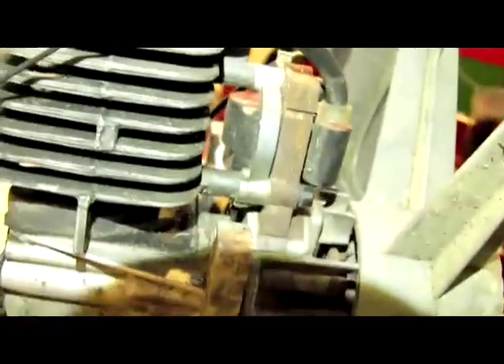That's why these have a pull string when you start them. The pull string actually connects to this part. So you pull it, you get the process going, the gas is sucked in, the electrical charge is created there, so the spark plug fires. Without this, the engine would never run — that's basically what causes that electrical spark. Now, those magnets can be used to run the reed switch in this case.